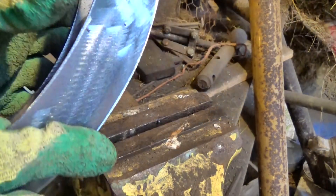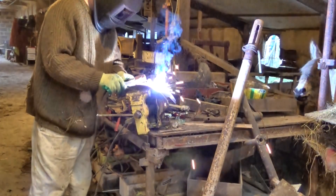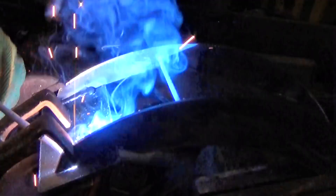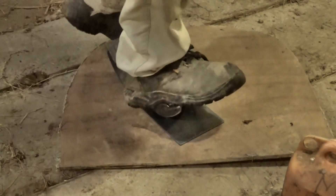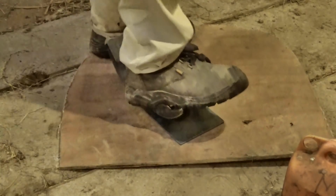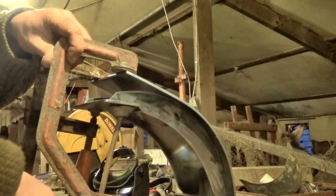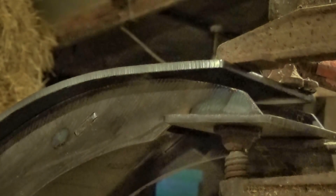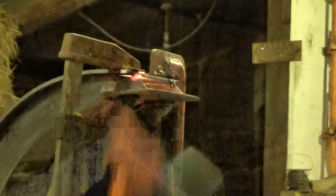This was my first attempt and I learned a lot. I didn't use a roller to bend the steel because I don't have one — I bent it around the forms by hand and by foot, working it slowly so as not to kink it. But as it bent it became slightly concave across its width, which obviously means it wouldn't work properly — it would hollow slightly across the top. See the gap in the middle? That shouldn't be there. When I make another one I'll either get the steel rolled properly or give it more support — three or four ribs instead of just two.